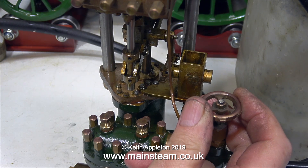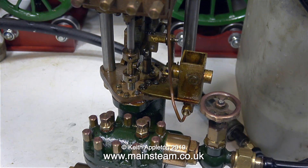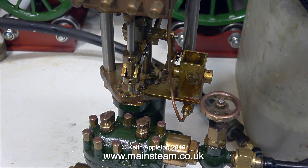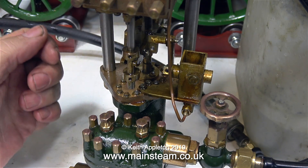While I'm waiting for the boiler to raise the steam that I need, I'm just giving it a run on some compressed air. And by the sound of it there's a leak somewhere — I can hear that — and one of the water valves is stuck.